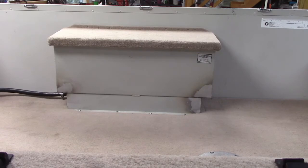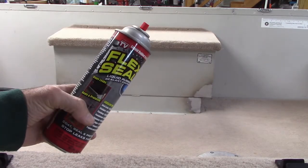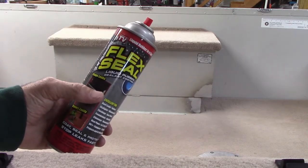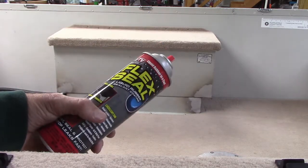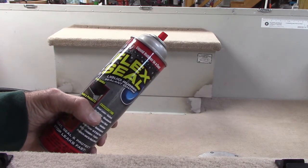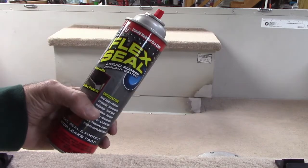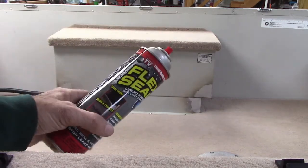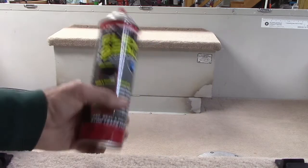The one last thing I wanted to do — I know what I repaired were stress cracks, so I know there's going to be a lot of stress on that same location. This boat takes a pounding out on the water and there's a chance those cracks could re-emerge. So I'm going to spray inside the live well with Flex Seal on that repair. This stuff is supposedly somewhat flexible, so even if a crack does come back this will help stop it from leaking. I've got the brazing rod to strengthen it and this stuff to perhaps keep it leak-proof for a while. If you can float a screen boat on this stuff it should work for what I need.